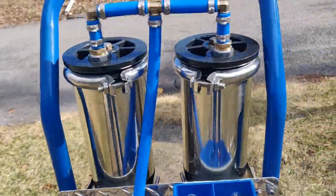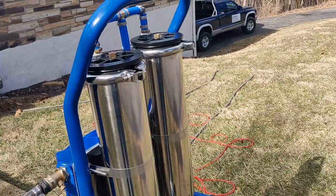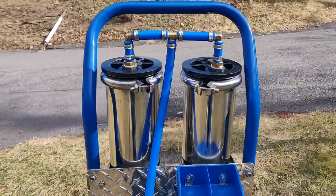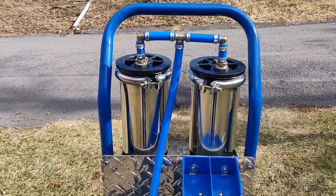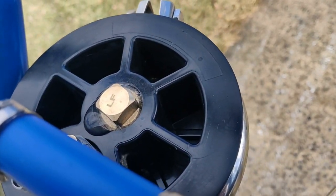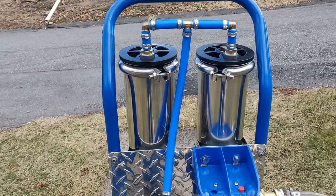The RO pressure vessels themselves are 4 inch by 40 inch, aka 40-40 pressure vessels. So you want to look for an RO 40-40 pressure vessel. I got mine from Coastal Water Filters off of eBay — I'll put a link in the description because those guys are awesome. These things were 70 bucks, and I had a leak issue. You can see the center ports on all these, even though they're properly torqued and thread sealed, they're leaking a little bit — and those guys, no problem, they're sending me new ones. Awesome group. So the pressure vessels were 70 bucks a piece.